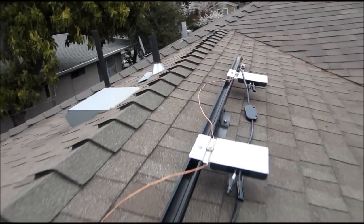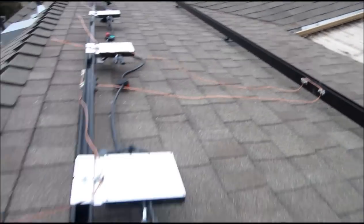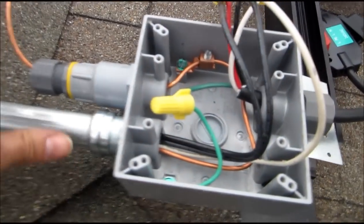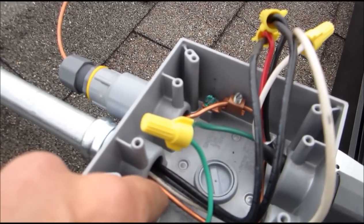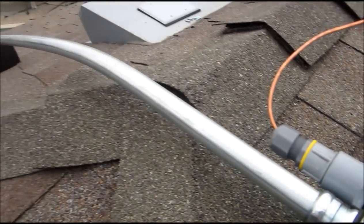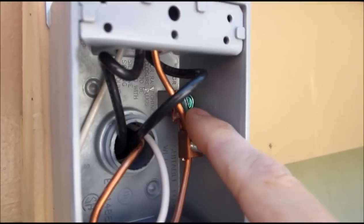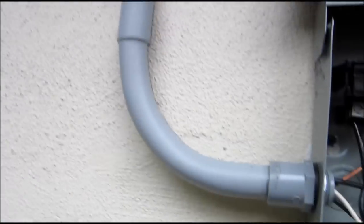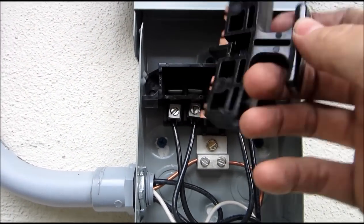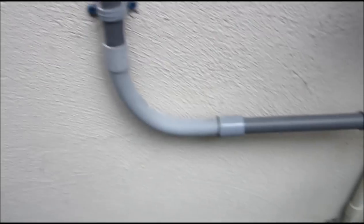Here's a quick tour of the wiring on the roof. The 8-gauge wire runs along each of the inverters and is bonded to each rail — two connections per rail — then continues through each inverter and is bonded to the junction box. The ground from the AC bus cable is grounded to a separate screw. This is spliced onto 10-gauge for the 240-volt run and 12-gauge for the neutral communication wire, which heads down to the junction box on the side of the house. The conduit continues down to the side of the house, where the sole purpose of the transition box is to switch from EMT to PVC. The 8-gauge unspliced wire bonds the metal conduit before switching to PVC.